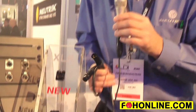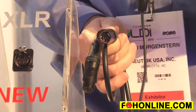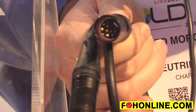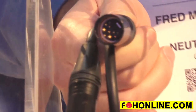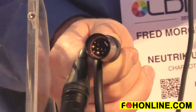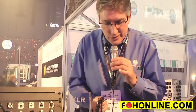The first one — let's take a look at these 10-pin XLRs. Hopefully you can see here in the camera that you've got two big pins for power: that's 16 amp up to 50 volt, and also eight pins to carry Ethernet-style data and up to CAT5e performance. We think this is going to be great for manufacturers who've got a remote device they want to both power up and also be able to talk to using digital data. This is coming out soon — the 10-pin XLR series.